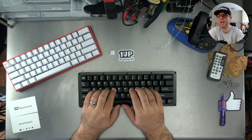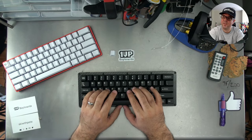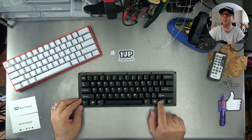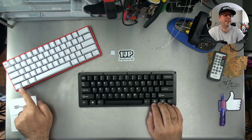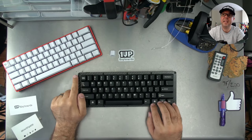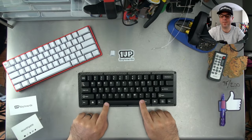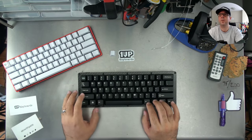What do you think of Razer keyboard? Tychus Man 77, I would avoid Razer keyboard. If you're thinking about buying one of the mass-produced keyboards, I tend towards the Cooler Masters. The reason is what's called the standard bottom row. You can see it here: 3 on the left, spacebar, 4 equal size on the right. The ones on the left and the ones on the right are all equal size. That's called the standard bottom row. Most keycaps are made with standard bottom rows. So I avoid the Razer because the Razer has different sized keycaps in the bottom row. They even have some that have shorter spacebars, which are very hard to find. So I tend towards these ones, and Cooler Master is one of my favorite brands because they do that.